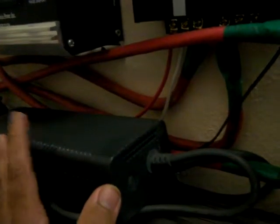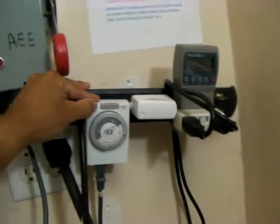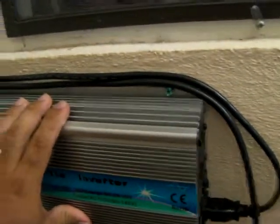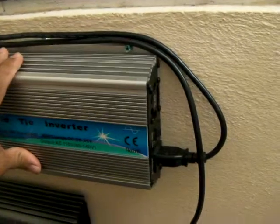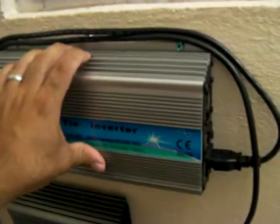So I decided to use an extra Xbox 360 adapter. I checked the specs — it was around 14 volts and 4 amps — and this fan only uses 1 amp for cranking and 1 continuous amp after it starts. I connected it to a timer and programmed the timer for the peak hours. This will be the primary fan, and since I'll be monitoring the system when I'm here, I'll just keep an eye on the inverter fan.